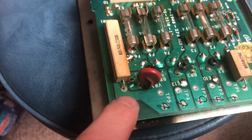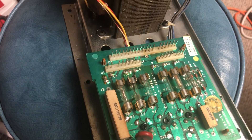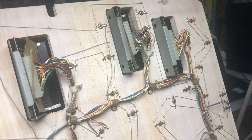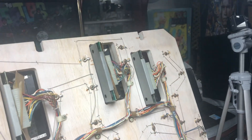This is garbage — you can see it. Yeah, this will go into the garbage and we will be putting a brand new one in. The cabinet I just went through, vacuumed it all out, went through all the displays and fixed all the cold solder joints. I basically just wanted to reflow every display.